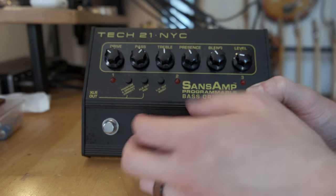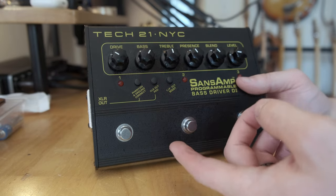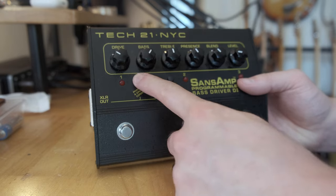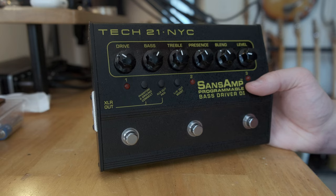Or use it the opposite way. If you're in the studio and you have an XLR cable connected, you don't want to turn off phantom power on your device. You just hit this button and it shuts it right down. But it's really great. That way it doesn't introduce ground loops or any wacky stuff when you're running phantom power.